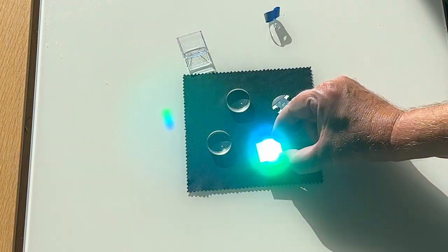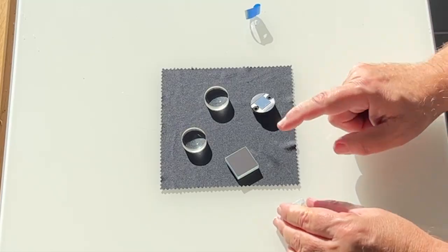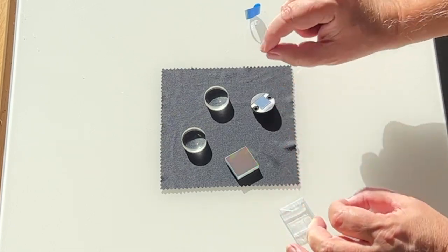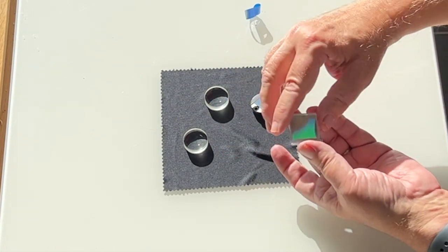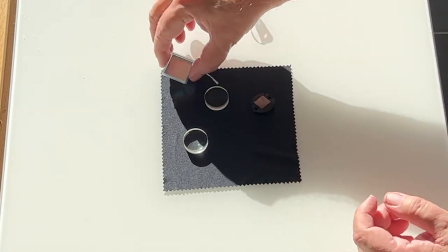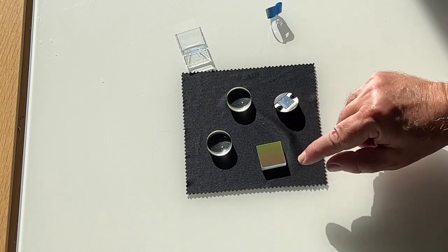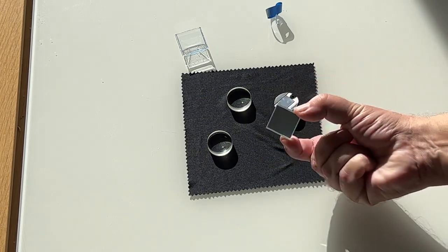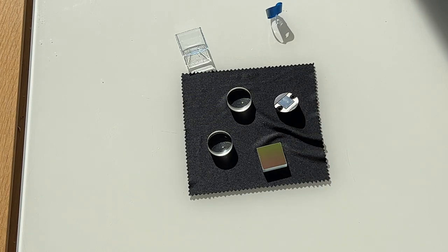Be very careful — always take the grating by the edges and never touch the engraved surface with your fingers, even with cotton, even with a brush, even with a feather. Only observe it with your eyes. If you put your fingers on it you will kill the grating. When you don't need it, store it in its box with the engraved side always facing inwards. Know well how to recognize the engraved face — here 2400 lines per millimeter. The lines are very fine. It is the shiny surface that reflects light a little iridescent — this is the phenomenon of light diffraction. The unengraved surface works like a mirror.